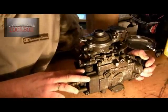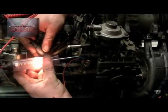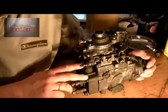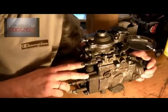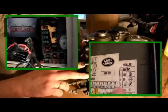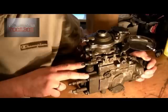For testing, the first thing to realise is that if you have no current here then the stop solenoid is not going to open. This could be one of a few factors — if you have an immobiliser like on a Discovery One, that might well be at fault not giving power down to your stop solenoid. It also could be a fuse, or it could be your glow plug relay on some 200s and 300 TDIs that run through the timed relay for the heater plugs.